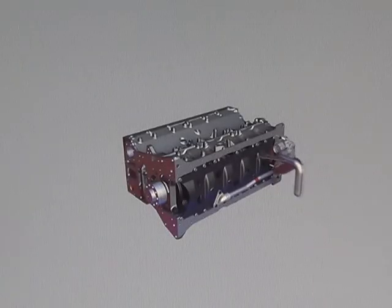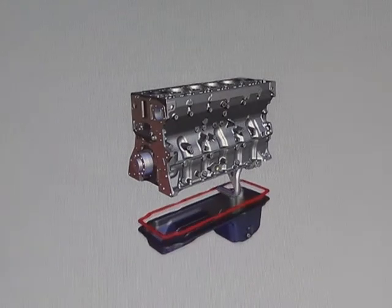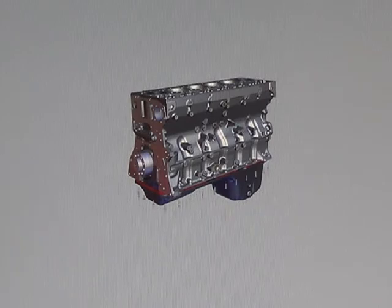The rigid internal suction tube configuration depends on whether the oil pan is to be mounted as a front or rear sump configuration. The pan is designed to have a shallow sump to provide clearance for the oil pump if the pan is mounted as a front sump configuration.